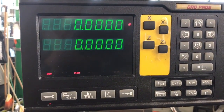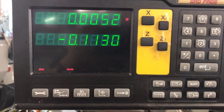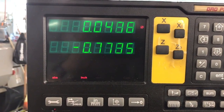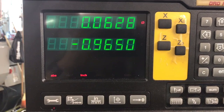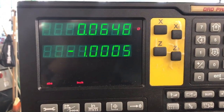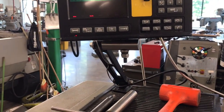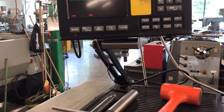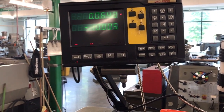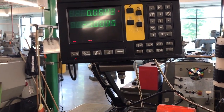What I want to do is get it to where both axes are moving, then keep track of where I go. I want to move over one inch. I got roughly 65 thousandths there. Now if I take 3/4 and divide it by 12 — doing it in my head — I believe I get a sixteenth, which is 62.5 thousandths. So I'm a little bit off — about two thousandths too steep. I need to adjust that until it runs through.